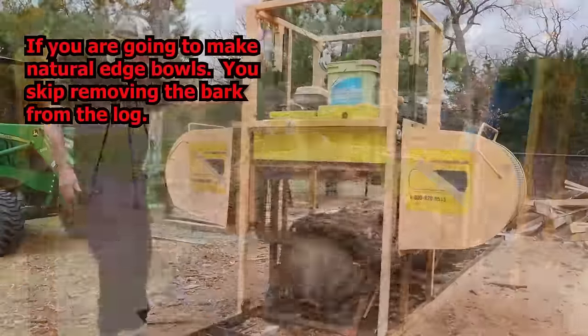As I was doing this, I just ran some figures on what these bowl blanks would sell for if I was selling them. Most of my wood, I just sell by the board feet, how many board feet are in them. Now, one thing you'll notice as you look at these charts is here's our 3-inch bowl blanks, but here's our 6-inch bowl blanks. And it takes longer to use a chainsaw and cut them up. It takes longer to go in there on a circle jig and cut them up. It even takes longer to anchor seal a 6-inch bowl blank versus a 3. There's just more volume there. But it's not a lot. You see the numbers, it's controllable and usable.